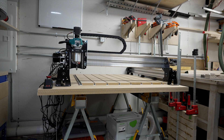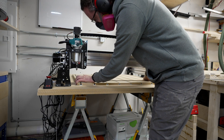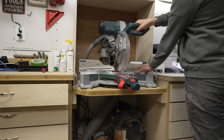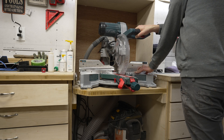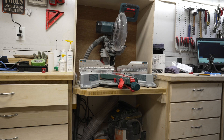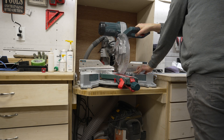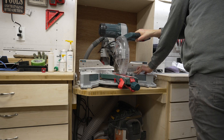A quick test fit with the end pieces and everything looks perfect — we're almost exactly the total width of the cut surface. The T-track I bought was 36 inches, and I debated leaving it a little bit long, but I thought aesthetically I liked it better if it all matched. So I used the same setting on the miter saw and went slow to cut each piece of this aluminum T-track to the same length. I don't love cutting aluminum, but it works — if you go slow and don't mind the odd piece of sharp metal fragments hitting your hand.